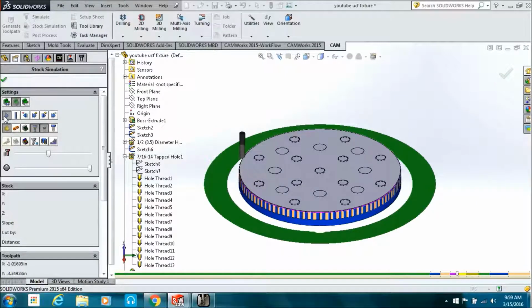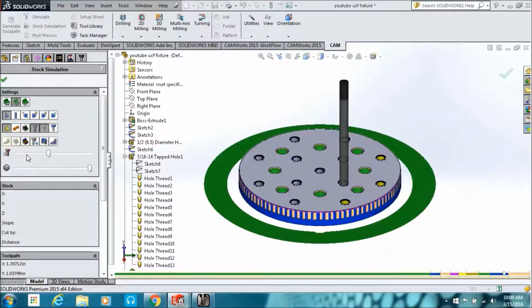You see it leaving the old purple on there, let you know that it's cutting. Goes a spot drill. And notice we're going to use the same size spot drill on all of them to do the center drilling and chamfering at the same time. Now we're doing a 1/2 inch drill. Tap drill. And tap.